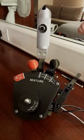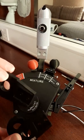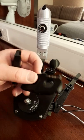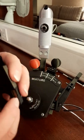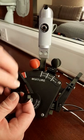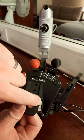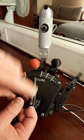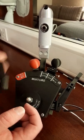Well, hello everyone. Today we're going to be fitting some new parts to test these, so I thought it would be an opportunity to have a look inside. These are currently for the magnets for the levers. As you can see, they've had to be recessed because with the Hall effect sensor, if it's too close to all these separate magnets, then you'll end up with the output wibbling as you go past them. Once you move them away a bit, it smooths out the magnetic field and you get a nice movement.